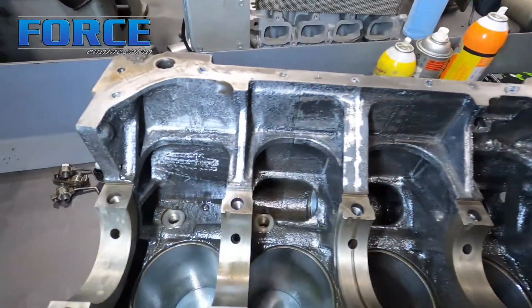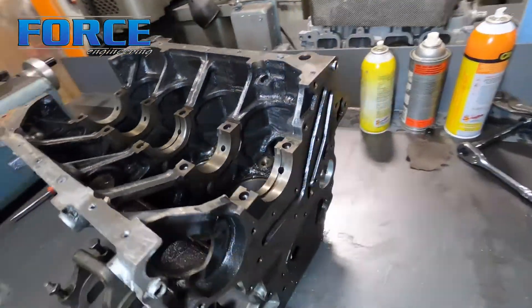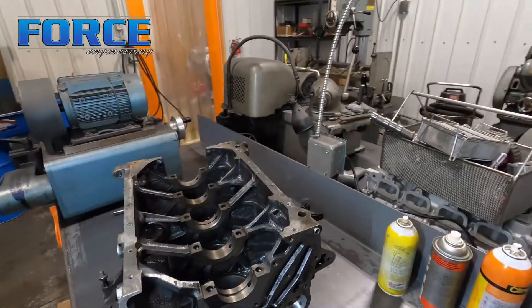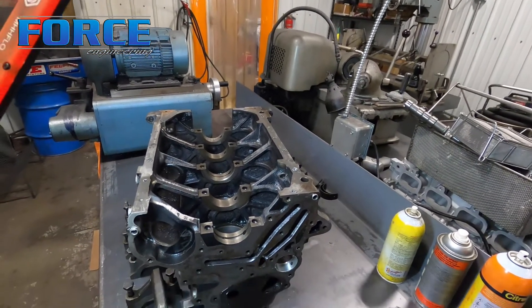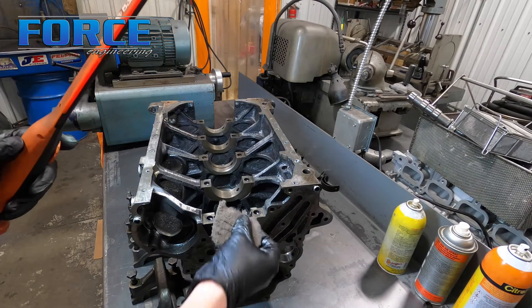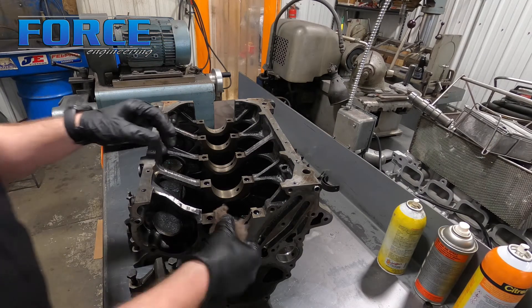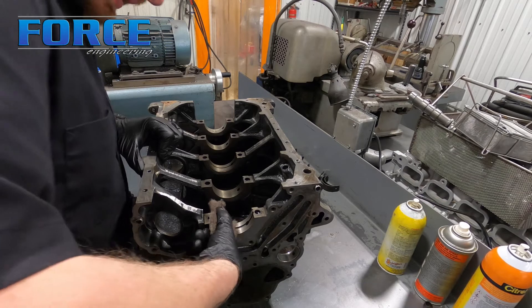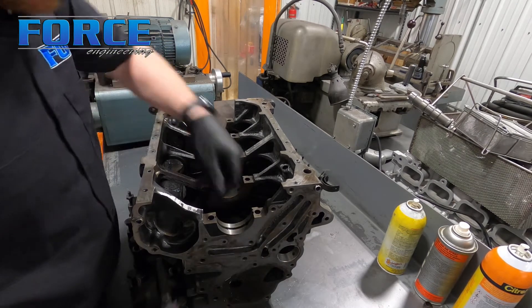You can see where I cut all the casting flash off and cleaned up the oil galley. The next step is I'm going to grab some SOS pad and clean these surfaces up - just start doing that now. The reason I do this is to pull up any corrosion that's built up and clean off any small spots of it.